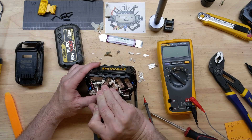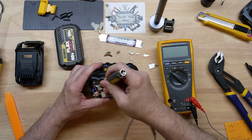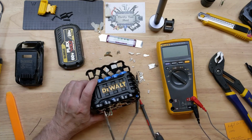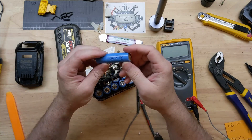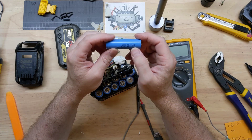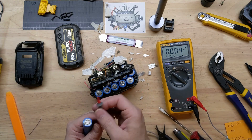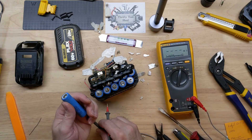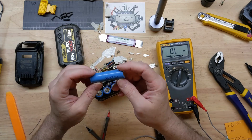I'm taking a little more care on this side because I really don't want to have to replace the strips. They made this easy — and there we go: an 18650-20S Samsung cell, which is definitely reading zero. Even though you want low internal resistance between cells, this one actually showed zero across it. When you're charging this it's pretty much just a dead short, just heating up with no voltage rise — so it's completely dead.